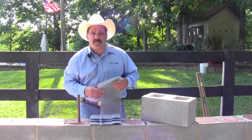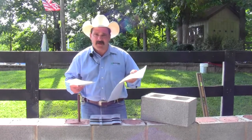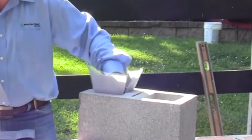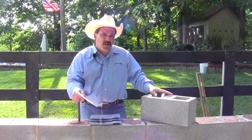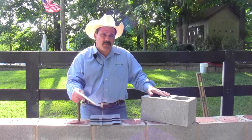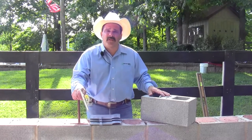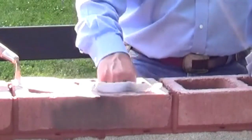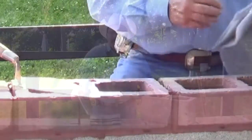Along with the pan, you get a mesh piece that goes on top. The longer mesh works with the full-size units — you just basically push it in there — and what happens is any mortar droppings from further construction get caught in the mat, and then they don't end up clogging your weep spout, so you're filtering any mortar that would get to your weep. The smaller mesh is used for half-high units. It's a little more convenient and a little faster.